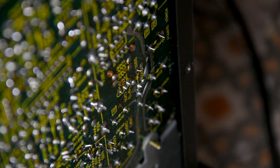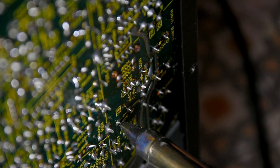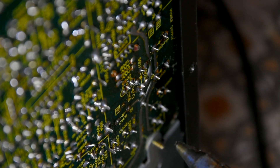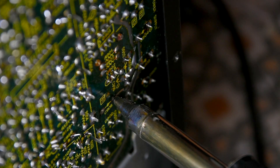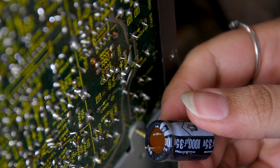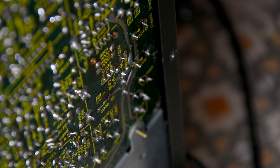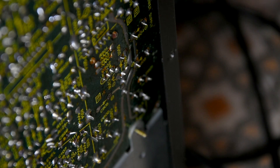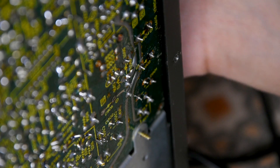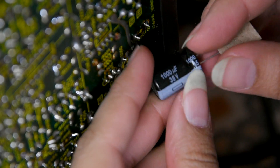It's freaking glued in that one, isn't it? Yeah, this is glued. Stupid glue! There we go, that's that light. Okay, let's not try and take all of these at once because I won't know which one's which. This one - a thousand microfarad. And thirty-five volts. So, thirty-five volts, thousand microfarad. Oh, I think that's the one. Look - thirty-five volts and a thousand microfarad! Yes, that's the one!